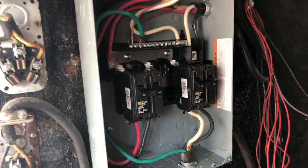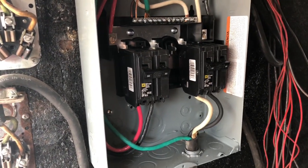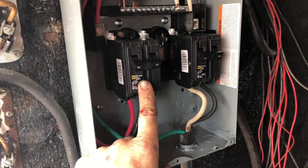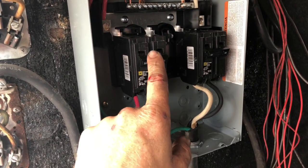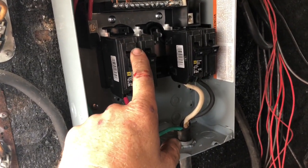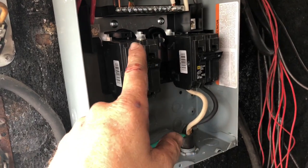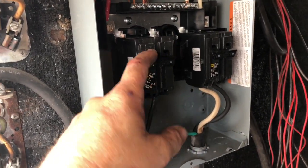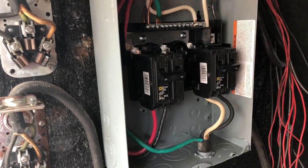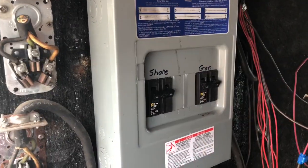Here's our full setup before we put the cover on. Shore power is on this side, generator is on this side. One quick note: if both breakers are on, the end of your shore power cord is hot and potentially deadly. So we install lockouts on the breakers that force you to take the lockout off and switch to the breaker you're not using. For customers, we use sliding lockouts so you can only open one breaker at a time. You do need common sense — always shut one breaker off before turning the other on, but the lockouts are a good reminder.